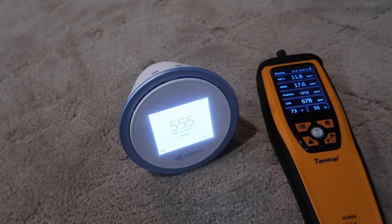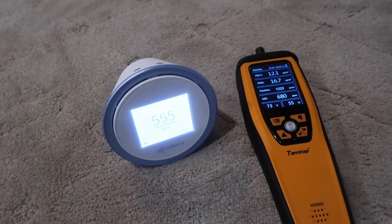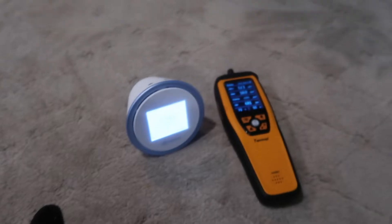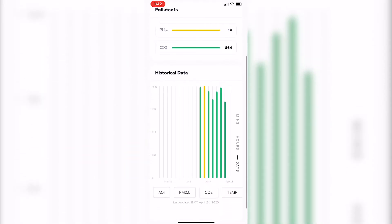You could use it on basically whatever you wanted. If you wanted to do it with a fresh air damper, you could rig it up with that and a relay. You could do it with a ventilating dehumidifier as well. Depending on the application, you'll have to make some different alterations. So this is what the Laser Egg app looks like. I chose the Laser Egg Plus CO2 because CO2 is what I want to use to control my ventilation.